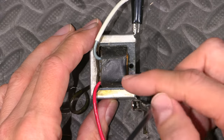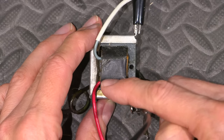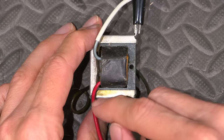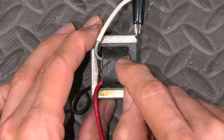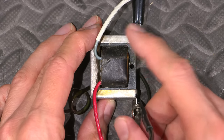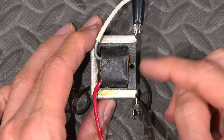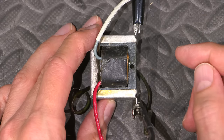Now, I want to do as little damage to the transformer as possible. So I either want to open this side, if the wire is open here, and then fix it from there, or open this side and fix it from here. I really don't want to peel the whole thing back and start digging where it's unnecessary. Now again, this is just a guess. It could be in the middle of the winding, it might even be open. Who knows at this point? We just know that the primary is open.